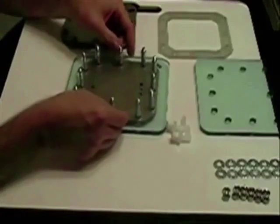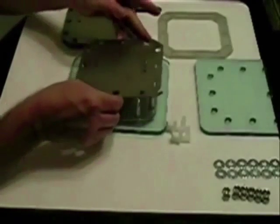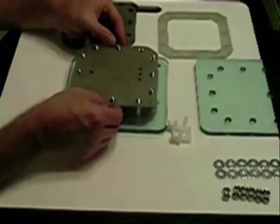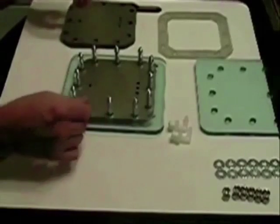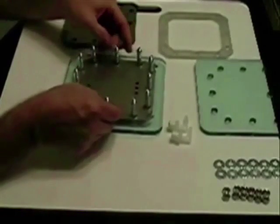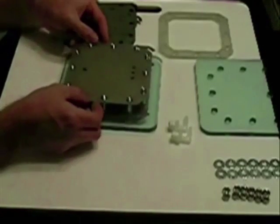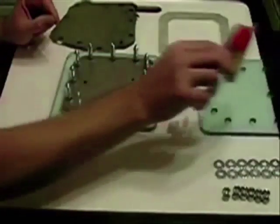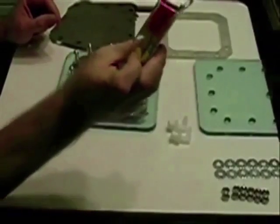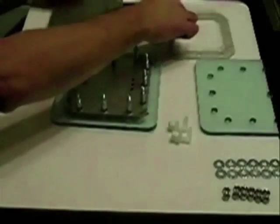Come back with another gasket. These plates have already been cleaned, sanded, and cleaned again. Come back with a second plate, drop it down, go with another gasket, another plate — alternating every other plate. You could put all the connections on one side, but that would not give you enough room to make your electrical connections. We want to use 10-gauge wire so it won't get hot.